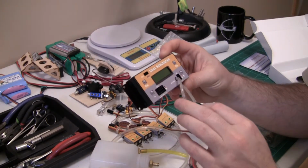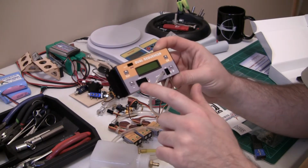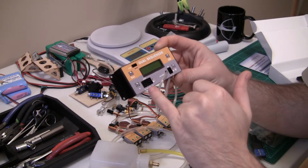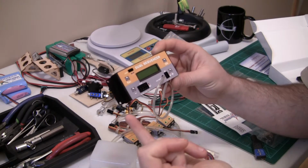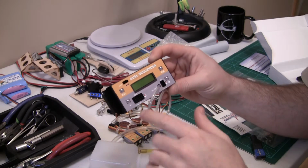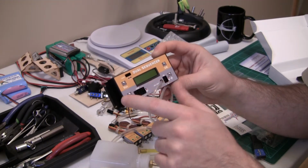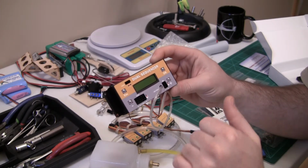It controls your gear and 2 gear doors that you can sequence however you want, which is going to be really nice for this F-14 Tomcat, because the front 2 doors have to open. Well, really only one of the front, but might as well put them on the same. Front 2 gear doors on one, they open first, and then have the second one open second, which you can do. I've already checked. You can delay between the 2. That way you don't have a hang up on the gear doors.